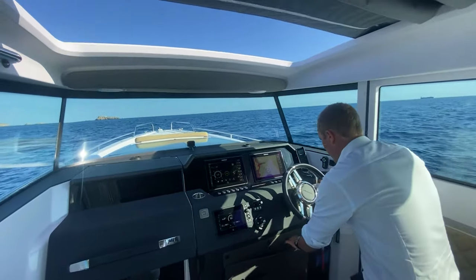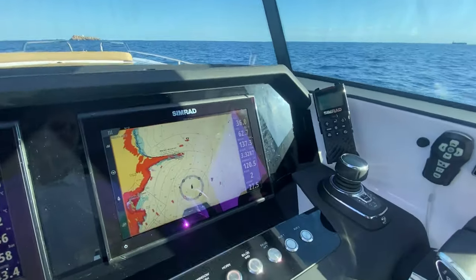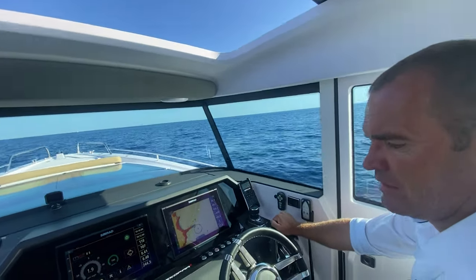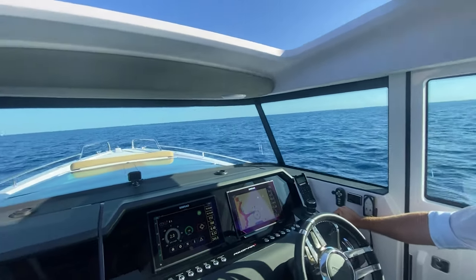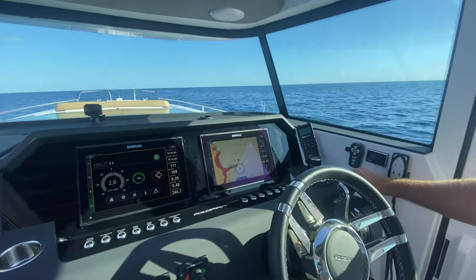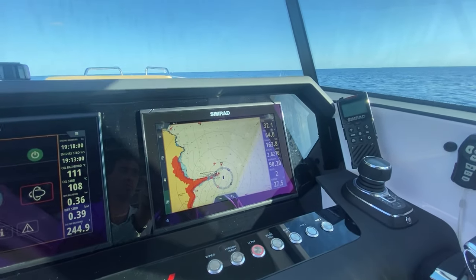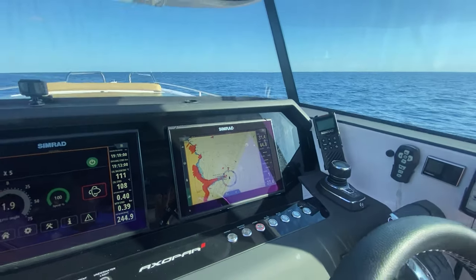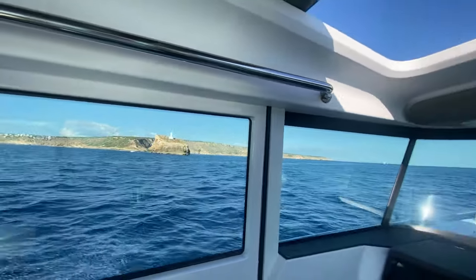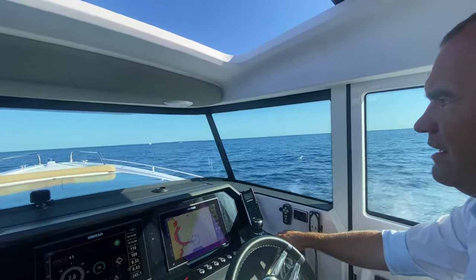We're running 37 knots — nothing is vibrating. We're now cruising at 32 knots, taking 2.8 liters per nautical mile, 90 liters per hour for both engines together on 4,500 RPM. Just trimming a little bit up to get a feeling. We even get a little bit less consumption. The boat has automatic trim, which you can switch on, but in fact the automatic trim is also trimming the boat based on a preset scale of one to five. It's always worth playing around with manual trimming to find the optimal fuel consumption.